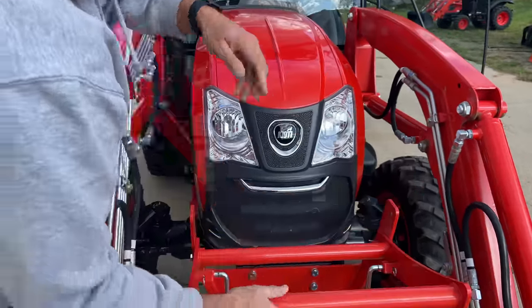You got your ranges. All right, so it's the three range. That's to be expected. Every tractor is going to have that in this size, whether it's a hydro or a gear drive. Low, neutral, medium, high, all that. This is going to be your front wheel assist, otherwise known as four-wheel drive. You just push that lever back and forth. At the heel down here, locking rear differential, that's basically where that's always at on every tractor. Does have a split brake, all right, with a parking brake right here, so you'd push that in, set the parking brake.